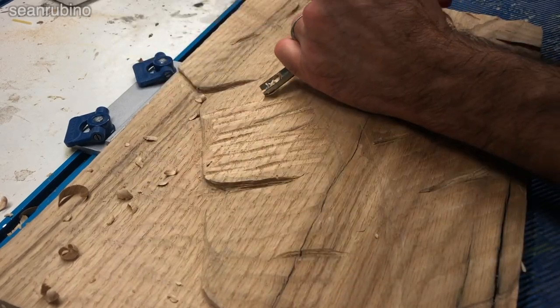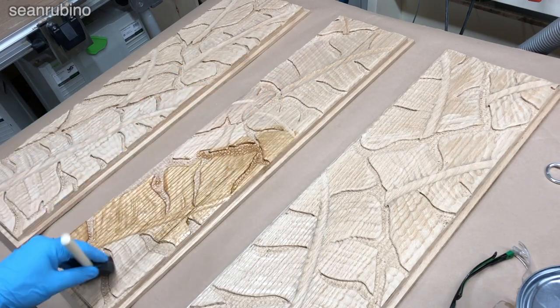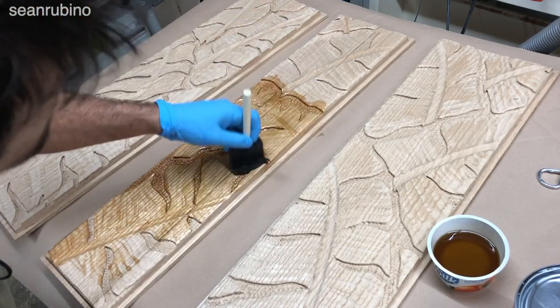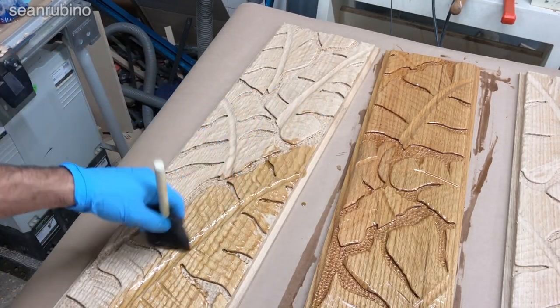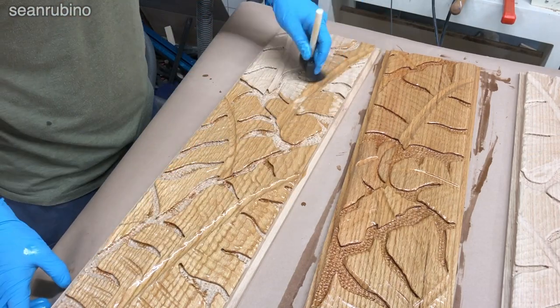Mission accomplished. To finish the panels, I flooded the surface with a sponge brush with diluted Epiphanes outdoor varnish. The background collected a lot of varnish, so the sponge was used to absorb it and move it around. If the finish were allowed to pool, it not only would take a long time to cure, but it would have a thick, crackled plastic look. Not a good thing. I applied 2 diluted coats and 1 full-strength coat.